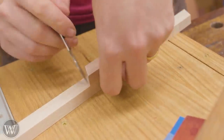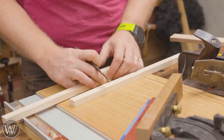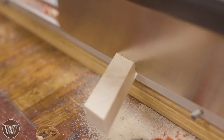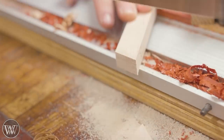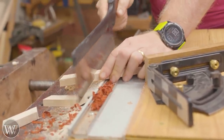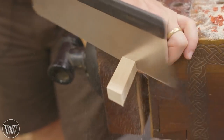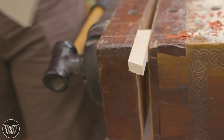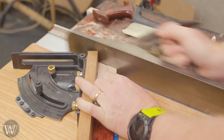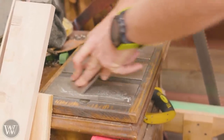Now we need to cut 12 of them — actually 13 or 14 because I'm probably going to mess up a few. I can lay one out, and since we're going to shoot them to the right length, I can mark them all out at one time and then cut them off. Some I can cut on the board as a bench hook, and the shorter ones I have to put in the vise to hold them. Then we can shoot them all to length, and because we have that stop already set up, it's very easy to make them all precisely the same length.